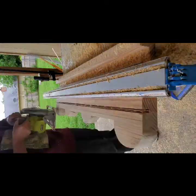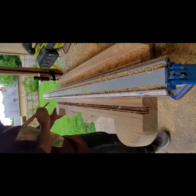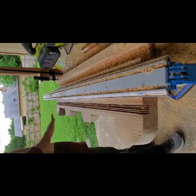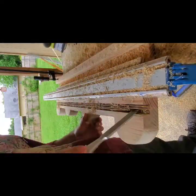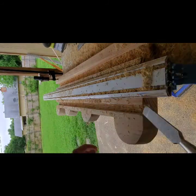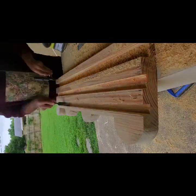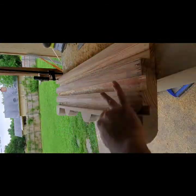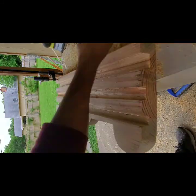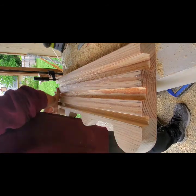Ripping it through — this is half an inch, so I'm doing this maybe four or five times. This is the last one I'm working on right now, so this is all you're going to see of the process. Once I get it all done, I'll use the chisel again, wiggle around, and it'll come off pretty easy. Take off the excess, and then we're going to start sanding with a small piece of folded sandpaper so it fits into the small cracks. We'll give all of them a pass through and we are moving forward.